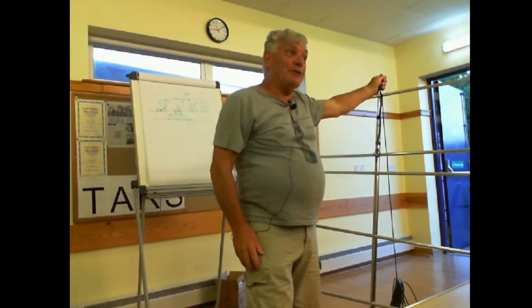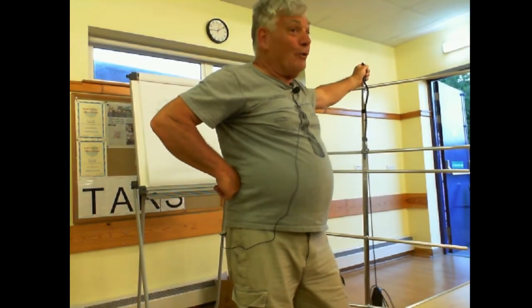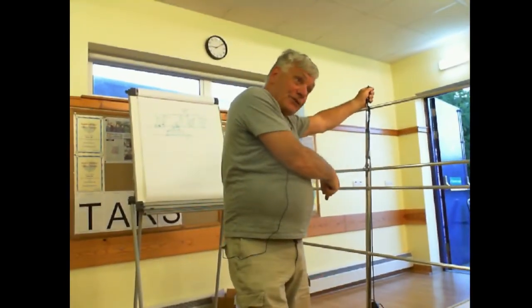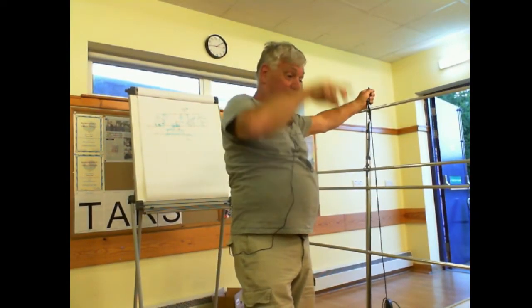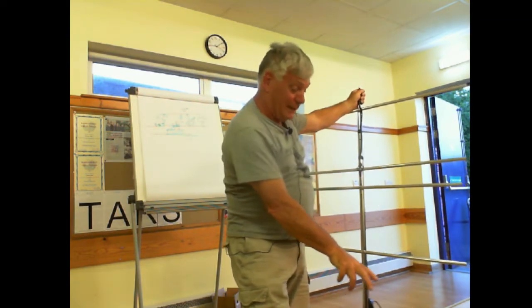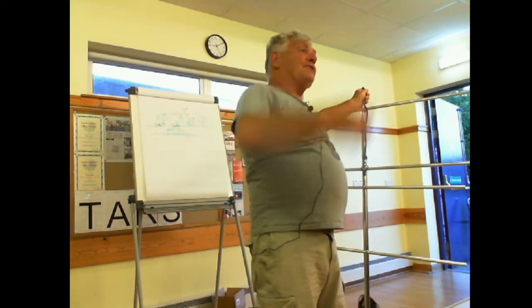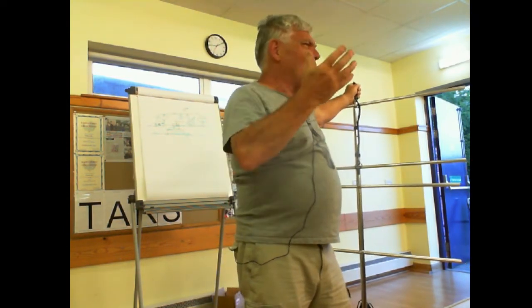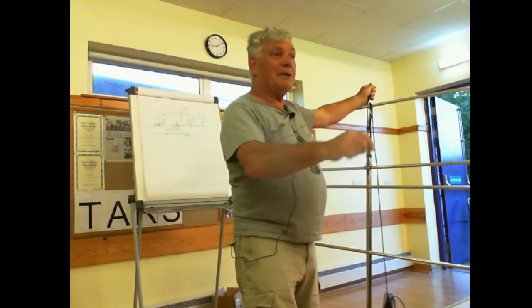And that's because your length of coax cable is probably resonant at the frequency that you're working at, and what you don't realise is that whatever is up the top there may be the inverse of what is at the bottom. So that may be reading absolutely perfect, but because you've got a complete resonant length of coax cable in it, what's down there is totally different, and it just will not tune. You go and take off 2 meters, chop it off, put a new connector on, connect it up, works a treat. Yeah, and you just think, well, why is that? I took 2 meters off and it works. Or if you go and add an extender piece, 2 meters long, and suddenly it all works.